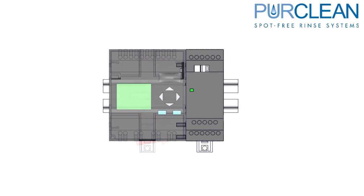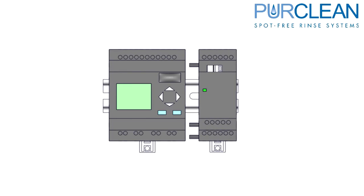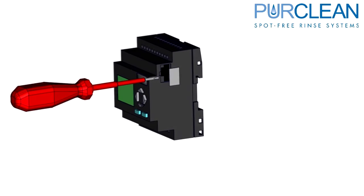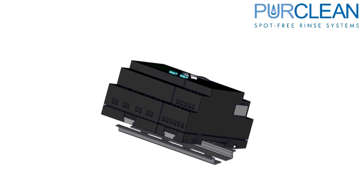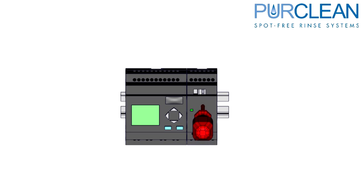You will also need to separate the extension away from the main controller about 1/2 inch in order to remove the extension. Before installing the new PLC with an extension, make sure you remove the communication tab dust cover from the main controller. This will allow access for the extension's communication tab. Once you have mounted the new PLC with an extension or two, don't forget to slide the communication tab to the left.